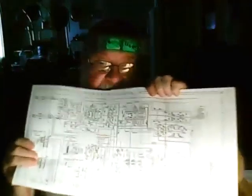when you're trying to track down a problem area, many times that area, let's say it should be, because there's a lot of IC chips on here, it should be 5 volts. Well, you go there and it's like 0.9 or 1.2, and you know that it's not coming in the way it's supposed to. Well, there's a problem there. You can take that pin and start going back, and you can find your area that way. So it makes it so much easier having these.